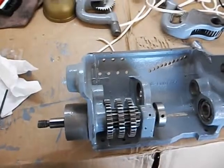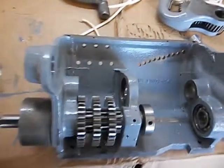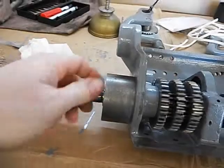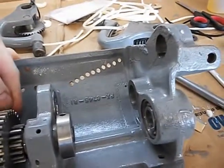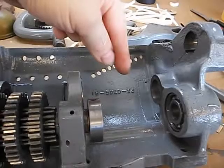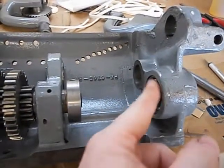Hey, it's a gearbox assembly video — not going to show the whole thing but I'll stop at points as I go. This is basically the input shaft; the drive gear rides on here and spins this set of wheels. This drives another set of gears which transfers power through this tumbler, through this shaft, through another tumbler to this shaft, which is another set of gears that eventually transfers to the gear on the lead screw for the output.